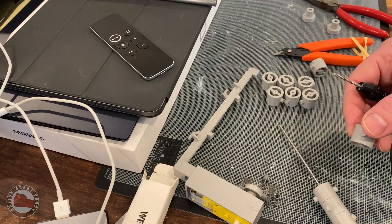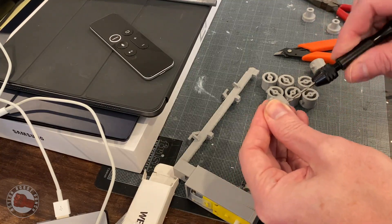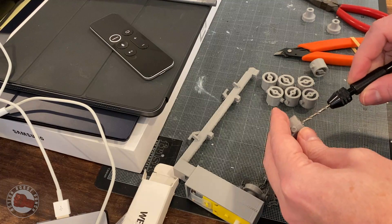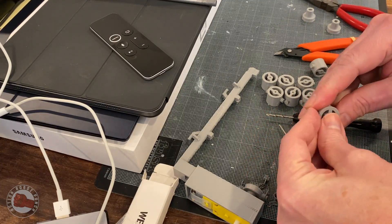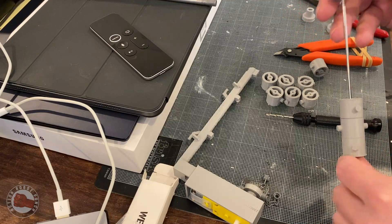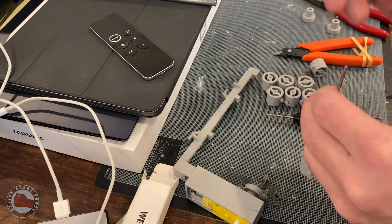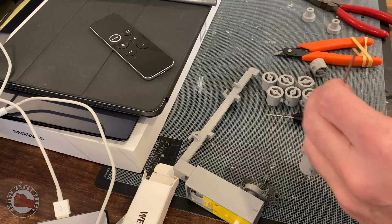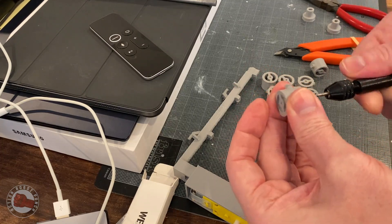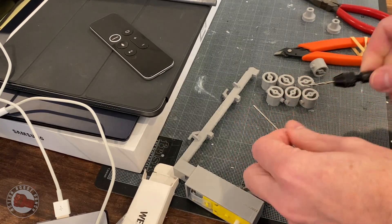Here's just a production line of little cylinders. I opted to make the cylinder in pieces instead of one giant monolithic cylinder. The advantage was that if something printed badly or got broken, I could replace that component easily without reprinting the entire tube. Then I was drilling out the holes to make sure they fit the metal shaft I was using to hold all the pieces. I decided to use metal running through the center because it would give the strength needed — it's pretty light for the strength it provides, and I wouldn't have to worry about the cylinder warping or doing anything weird while spinning under load.